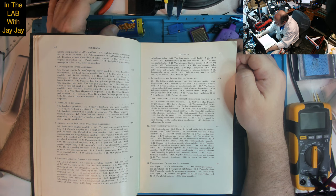energy levels and conductivity in semiconductors, the PN junction, junction and point contact diode rectifiers, the point contact transistor, the junction transistor, transistors and vacuum tubes, four terminal networks, equivalent circuit for the common base amplifier, the common emitter circuit, the common collector amplifier, summary of transistor amplifier characteristics, graphical analysis of large signal transistor performance, bias and stabilization, cascaded